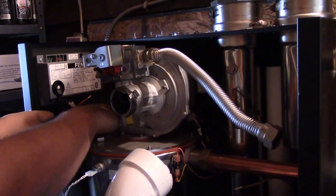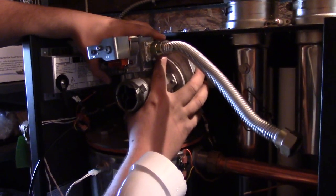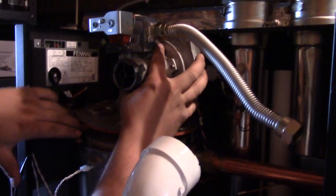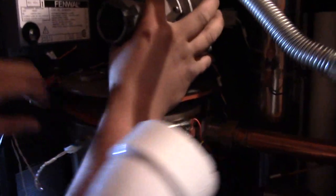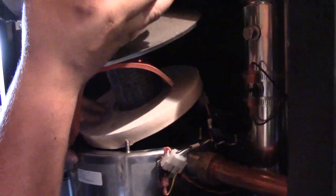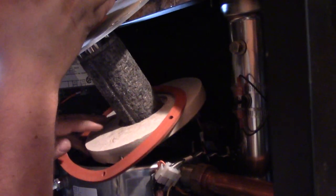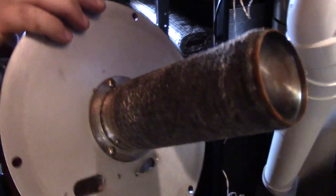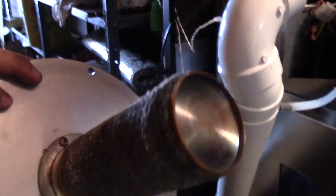This will lift straight out. You've got to be careful of the gaskets, and there's an insulator in here as well. You've got to be careful of the refractory — it's pretty fragile. There are also wiring connections for the motor in the back which you have to remove as well. This is the burner here — you can see it's got some dirt on it; some of that's just the refractory from pulling it off. We'll vacuum this out after with a shop vac.